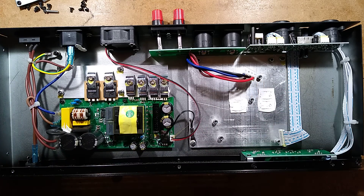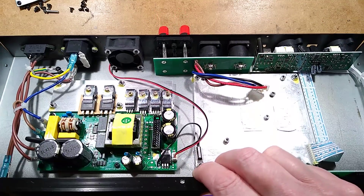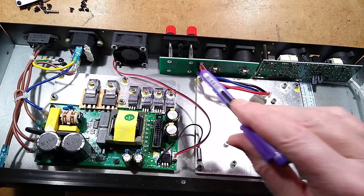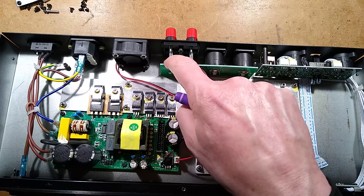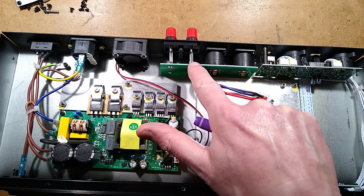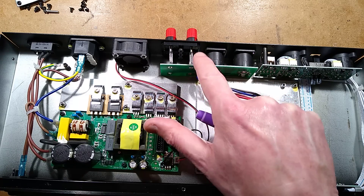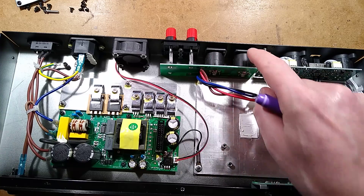The amplifier board itself — it's worth mentioning there's something I don't like much. The soldering at the back of the pillars for connecting the speakers is relatively okay on one side, but the other side is fairly dry. If you have a problem with any of these amplifiers and it's crackling when you wiggle those connections, check these solder joints. The other option is to switch over to the Speakons.